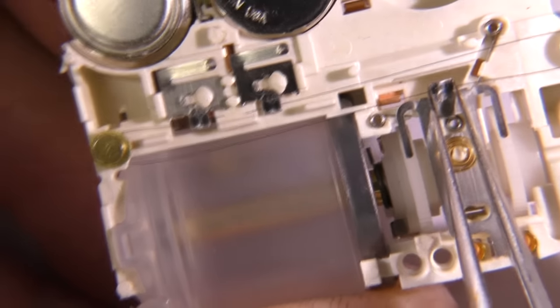If I apply about 3.5 volts to this muscle wire you can see it flips those ratchets alternately and turns the central shaft. It's pulling about 250 milliamps — obviously that chip might have some current limiting in there so I don't know how much current this would normally put into it. But it's a very neat system for producing a relatively high-torque, low-speed motion — no motor, no magnets, just a piece of wire. A very elegant little solution.